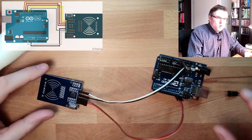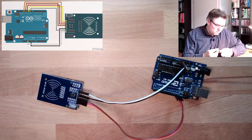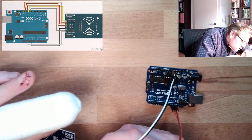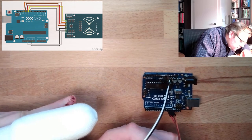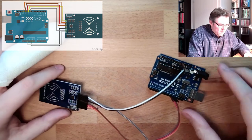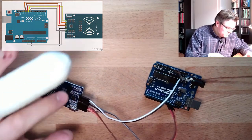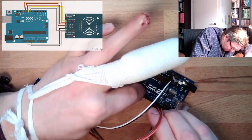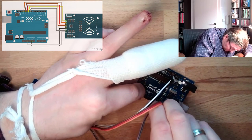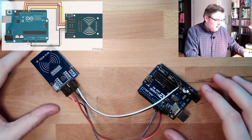Okay, and then we still need something. We still need a reset and some other information. The reset is in here between. And the SDA, serial data available, is here. I will connect them to other input and output pins. The reset is going to 9 and the serial data available is going to 10. That's it with the hardware setup.